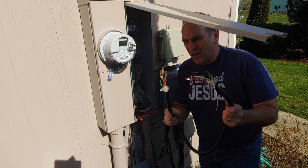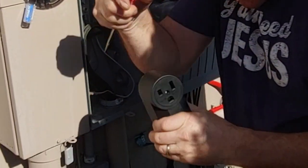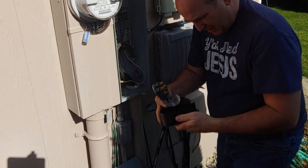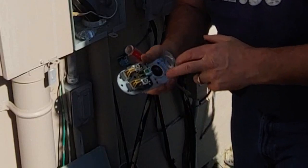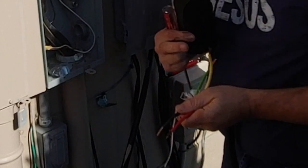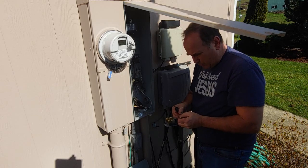Making a little progress. I got the end cut off and now I'll go ahead and put it on this thing here. Get your screwdriver, put it in the end here, and take out the center screw. Take the back off and put that aside. So we've got two hots and a ground — this is a four wire. Black and red are going to be hot, white and green are going to be ground. Fish this thing in. We're not going to use the white — we're going to use the red, the black, and the green.